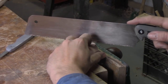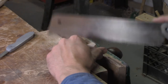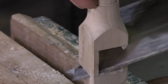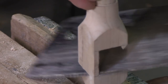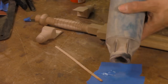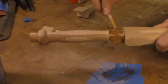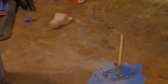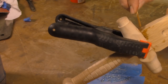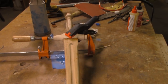I gave a lot of thought to how I wanted the cross piece actually attached to the blade. What I came up with was splitting it in half to get it on there and glue it on. I'm going in very carefully on the diagonal with a Japanese pull saw, going very slowly so it doesn't break out. I'm mixing up a little bit of epoxy and putting sanding dust directly from sanding the sword right into it — that gives me a thick paste that dries to a better color. I get the cross piece fitted on and clamped up, add some extra epoxy to fill any gaps, and let it dry overnight for maximum strength.